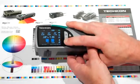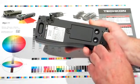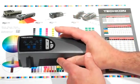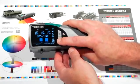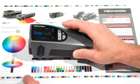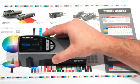The new scanning mode uses the tracking wheels on the bottom of the instrument, enabling the user to quickly scan color patches while maintaining perfect scan alignment. On the instrument, you select the media wedge function, which allows you to measure one or multiple row color bars. You align the measurement aperture in front of the first row of color patches, hold the green measure button down, and smoothly draw it across the color bar.